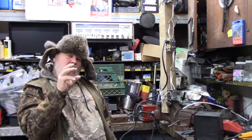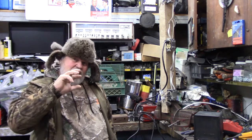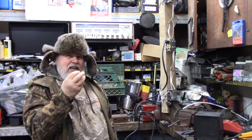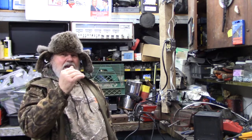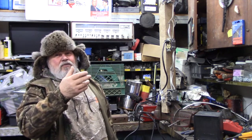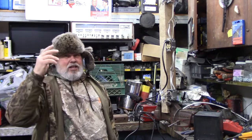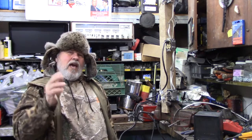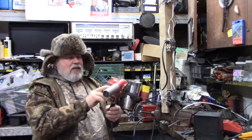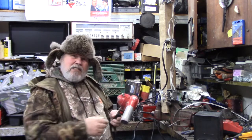The breaker has a thermocouple in it. It'll heat up and endure a certain time, maybe two to three minutes. It'll take maybe up to 115%, like 20 amps, and then eventually it'll come down to 15 amps. So this will blow the breaker, but it's a good load for our test this morning.